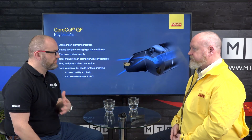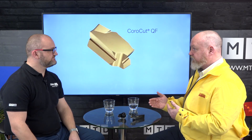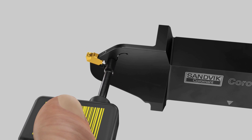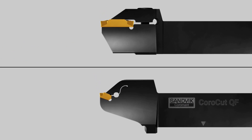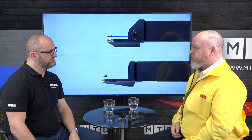With Sandvik Coromant, when a product is released there are traditionally lots of grades and chip breakers, and it's the same here. We have all the geometries needed for face grooving, and because the system is more reliable and safe, we can use some of the harder grades — for example in HRSA materials, using hard grades works extremely well with chip control. We have a range of chip breakers: the TF designed for most face grooving applications, a GF which is a ground insert for face grooving, and a round insert for profiling. The triple rail design makes it very stable for sideways turning and profiling, working well with non-linear toolpaths from CAM systems.